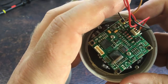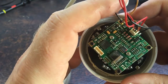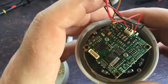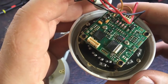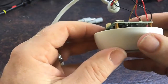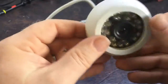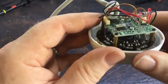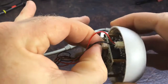I'm not seeing anything obvious on the board. The top board here is the actual camera board with the camera mounted underneath it. The other board is just for the infrared LEDs and the light sensor which turns them on and off as required. Nothing particularly exciting about that part, but obviously this camera has got an issue somewhere because otherwise it wouldn't be doing what it's doing.